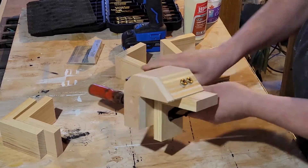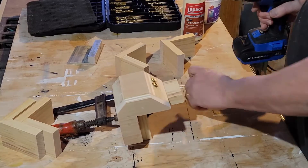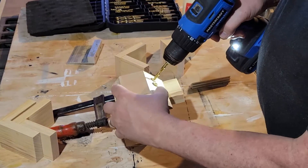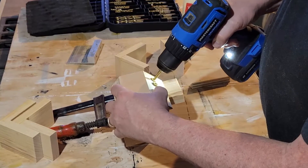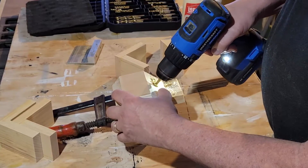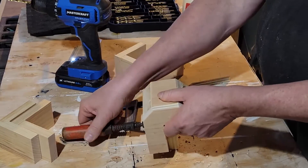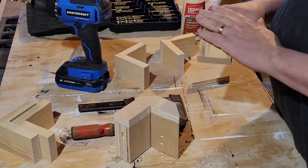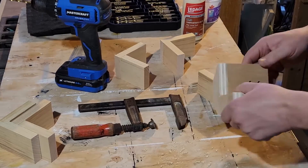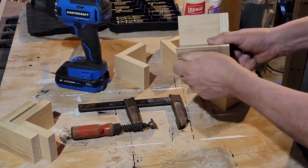I'm going to set this up and drill a hole. What I like most about this at this point is these inserts — they're very stable, very easy to put in, and they guide the drill bit very well. The other thing I want to mention is this is the larger of the two drill sizes. I did not want to go pounding through the joint with the miter because it is at 45 degrees and I figured it might end up damaging it. So I'm only going to do the one for this and we'll see how it all works out.